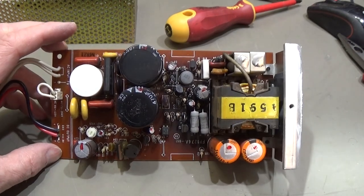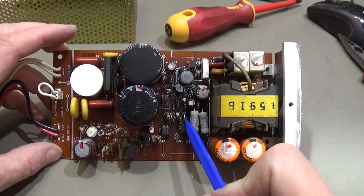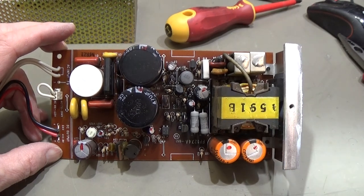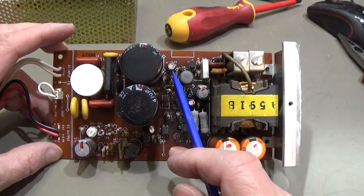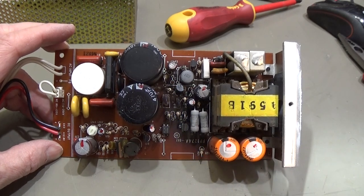And here we have our power supply already taken apart, and what we already can see if we have a look at the PCB is that it is quite dark here, so that shows that we have a heavy heat here inside our power supply, which is of course not good here for our capacitors, which are here on the PCB.